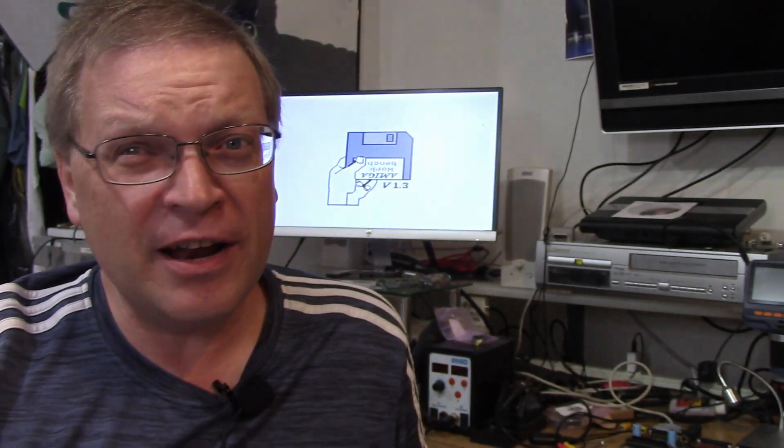So are we done? Nay. Recapping is an important thing talked about a lot in the Amiga community, especially with the Amiga 600, 1200, 4000, and CD32, because those machines used little SMD caps that tend to leak a little more than the through-hole caps used in the Amiga 1500, 2000, and 3000. It just had to do with the generation and quality of caps put in there.